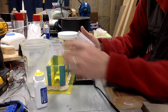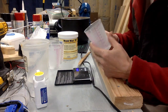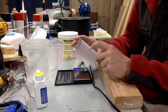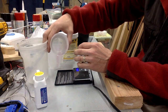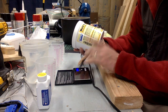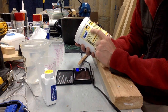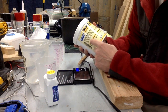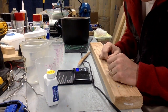My scale only goes up to 100 grams, so I can't fill this all in one shot. This empty cup is 12 grams, so I can probably only do about a third at a time. I'm gonna fill up as much as I can and pour it into this bigger jug until I get all of part A totaling my seven and a half ounces. Remember it's 100 of this to 5 of that by weight, so I'll take my total weight in grams and figure out what a twentieth of that is to get part B. I'll take my time - that 90-minute working time is in your favor.